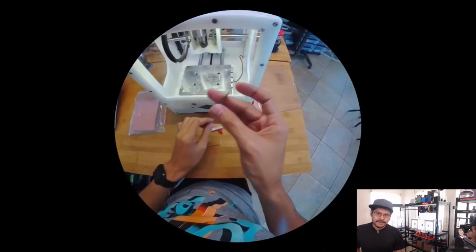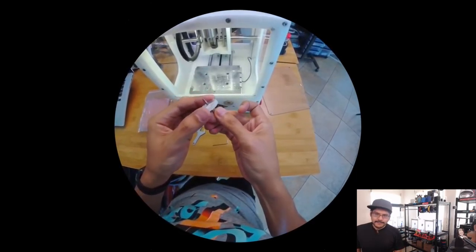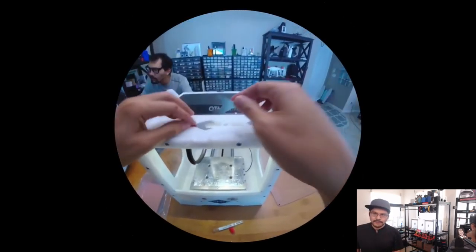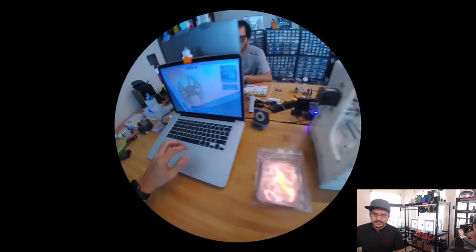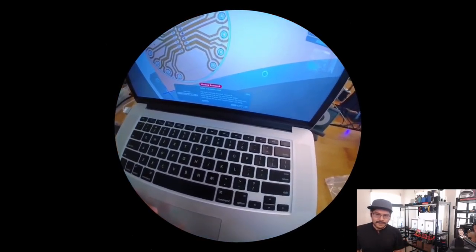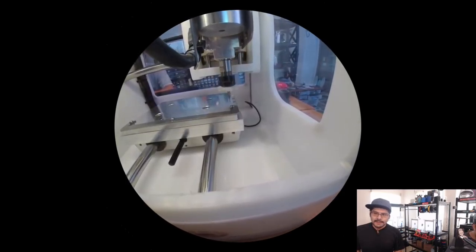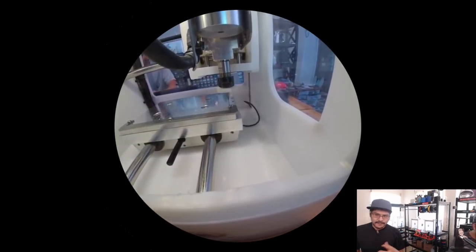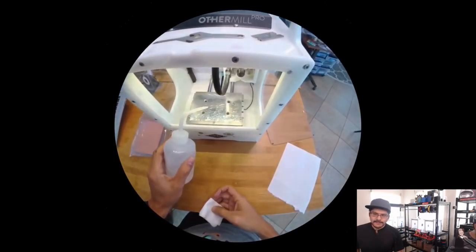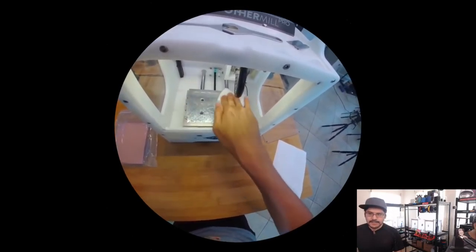The tool that I'm using to mill is a 1/32-inch flat-end mill. This is my favorite type of tool to use. I'm a big fan of just using one tool to do all of the work, that way you don't have to change out the tool every so often. Again, the Bantam tool software is so legit, and it makes the workflow incredibly easy. You don't have to do feeds and speeds and all this other stuff that I'm used to with milling wood and other objects, because it natively supports Eagle and Gerber files.